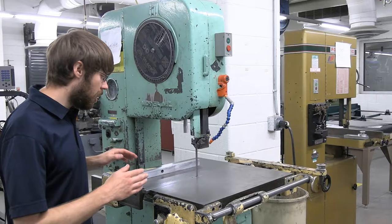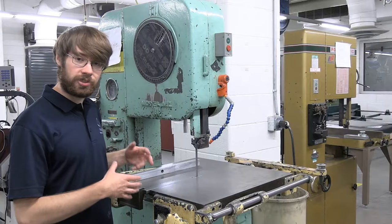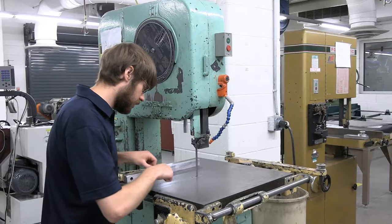You don't need to put a lot of force into it. Always let the blade do the work and let the blade pick the speed that it wants. It's more important to have a consistent pressure on the work piece than to really push it hard into the blade.